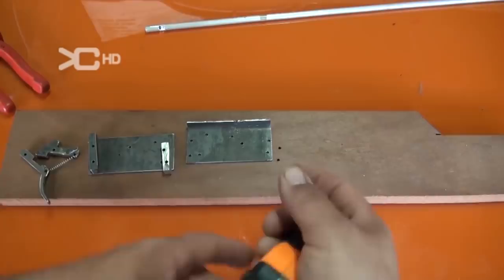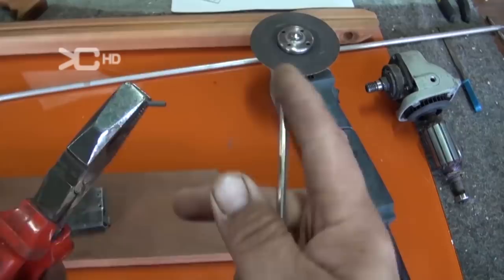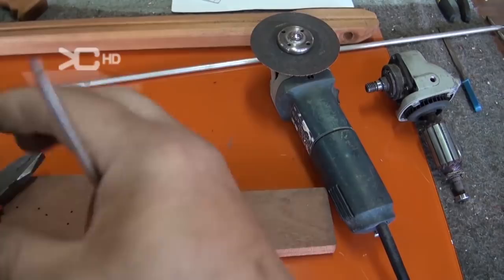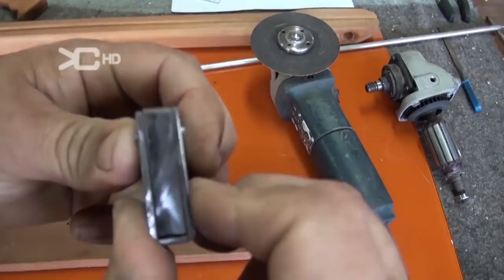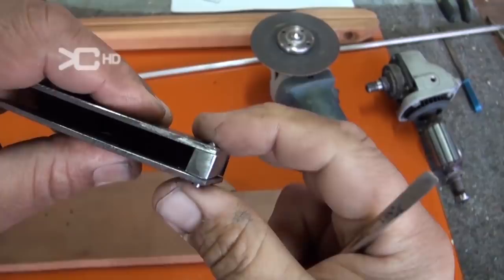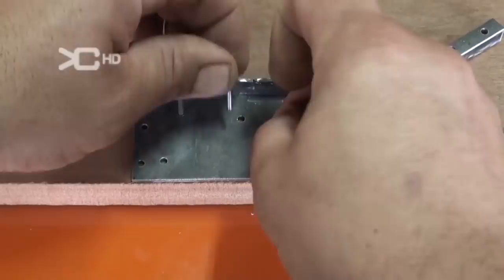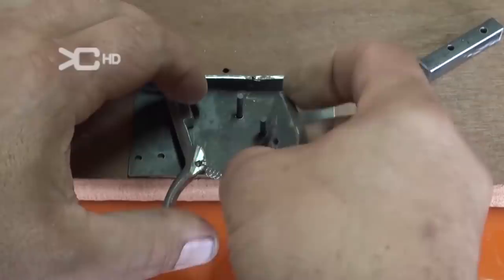Now I'm going to prepare the tips and explain how I'm going to mount it. Briefly, with an angle grinder — which I haven't done until now but from here on yes — we clamp our small tip and file the heads to make them square. The idea is to give it the minimum number of hammer blows. Now we take it, insert it here, and check that nothing protrudes more than just the right amount. Because here in the center it is hollow, and when we need to strike I don't want to damage and block the triggers in the middle. Therefore, these pins we are going to prepare — it's just a matter of placing these three pins here: one, two, and three — to mount our mechanism.